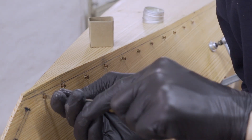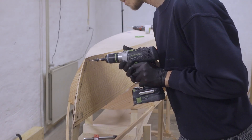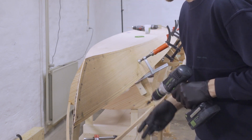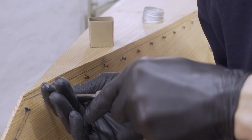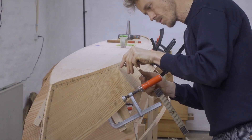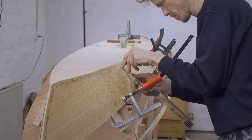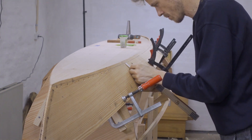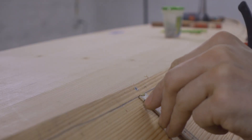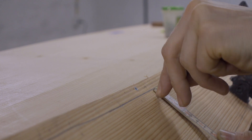From the stem to the watertight bulkhead the plank is fastened to the bottom with screws, because the plank is almost at 90 degrees to the bottom. Between the two watertight bulkheads the angle gets steeper so screws won't work very well — clenched nails or copper nails will be used instead. To make sure I get my screws straight into the middle of the bottom panel I'm holding my drill almost horizontal, then driving 3 by 20 millimeter bronze screws. In the imperial world a three quarter inch long number six screw would be a good choice. Then I'm marking the location for the rest of the fastenings — I'll be using copper rivets but clenched nails will work well too. I'm using an awl to make the marks, since a precise dimple made by a sharp awl will help my drill bit go straight in instead of drifting off into the soft early wood.